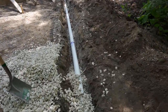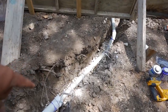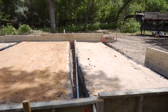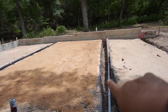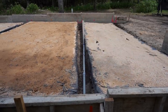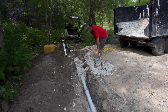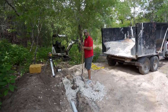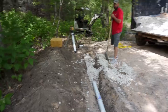We have the pipe in the ditch with gravel underneath, plumbed from here with a two-inch pipe all the way in. That's where the pipe comes up — that's going to be the drain for the sink. We tucked the pipe to the outside edge of the ditch, not the middle, because the beam is in the middle. The ditch is also dug extra deep so the stirrups are above the pipe. Now we cover it up with limestone — about three or four inches on top — then the cloth, then dirt back on top.